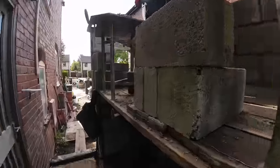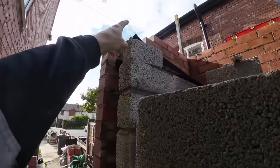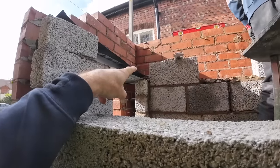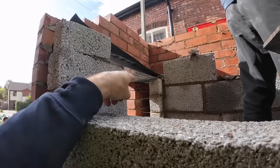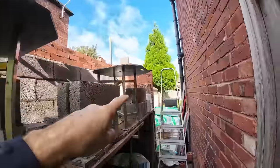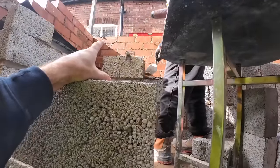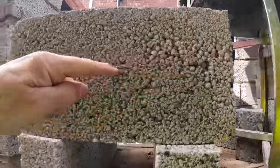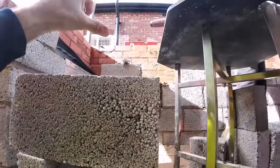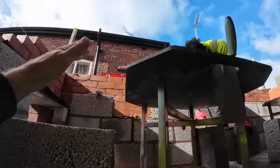And then same here for this end, but I've also got 140 pieces to go across there to bring it back into courses, because the lintels are at a funny height. So those cuts to be done, these cuts to be done, those two cuts to be done, and then we've got a split course on top here, which is just a block straight down the middle, which is lucky. That's half as many cuts to do, and that'll bring us back into gauge. And then we've got a course block on top of that, the 4x3 wall plate on top of that.